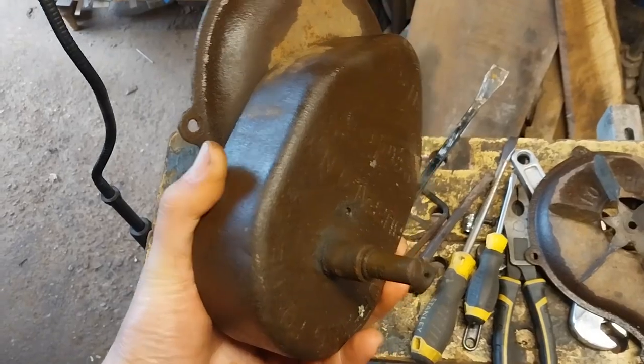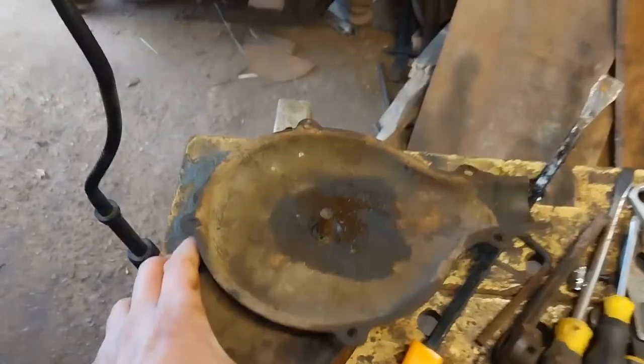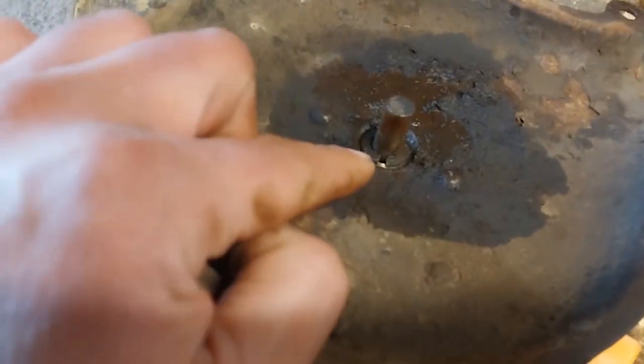just because I can see there's a lot of gunk in there and I can't clearly see whether it's just gunk or a rust weld, because when two pieces of metal rust next to each other, they can actually fuse together. It's a weak bond, but you do need to break it. So I'm going to try and do that very gently. Before we start finagling things at the front, I want to do a little bit of investigation here.